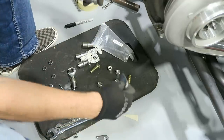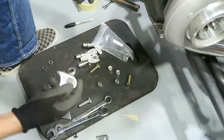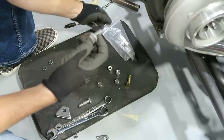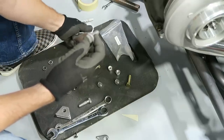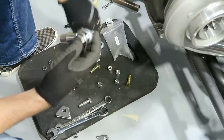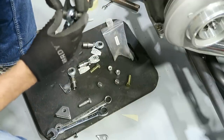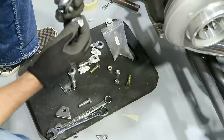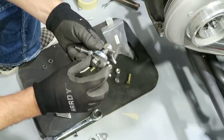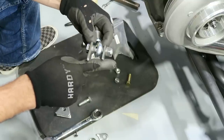All right, so the recipe goes like this. Bolt, fab tab, spacer, and let's see, put the right-handed ones out here, another spacer, another tab. Nut to finish it off. What I'm doing here is using two different size tabs. You can see this one is longer than this one, and that's just to give me that angle that I need on the tube.